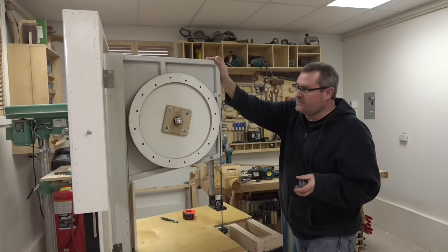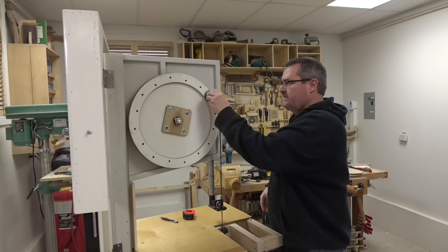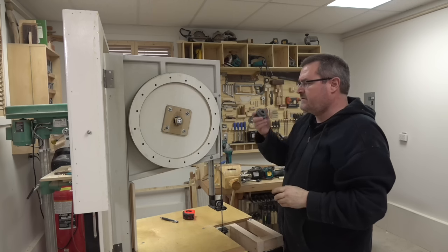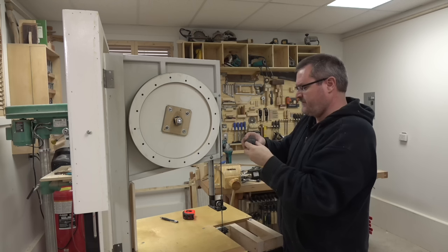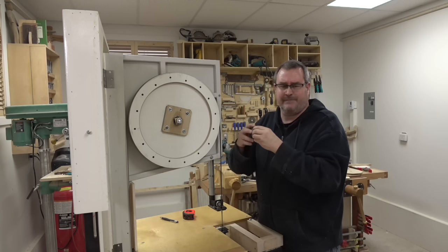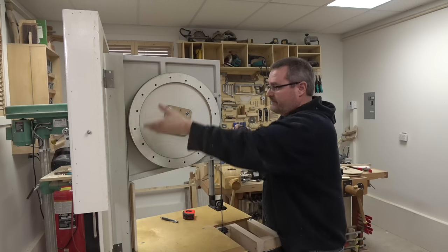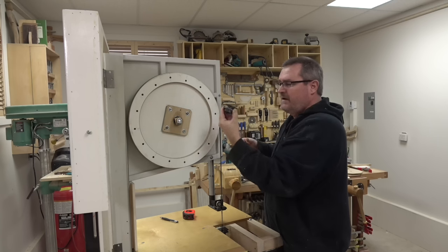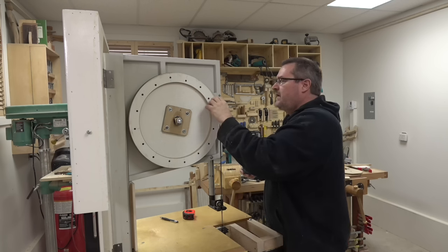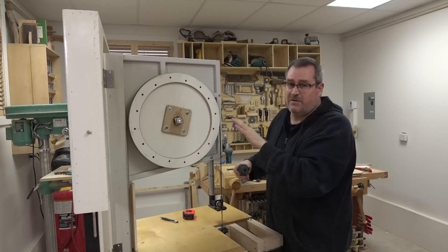And that's to replace the upper wheel with a series of smaller wheels that follow that curve, you could say. And what they would do is, first of all, there'd be that many more areas for the load to go, so it'd be divided over the whole however many of them there are. I don't think this would be big enough, a little bit bigger than this, maybe 3-inch wheels. And so every shaft would take part of the load. So less load on the bearings.